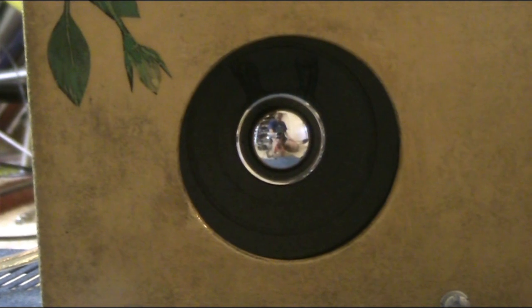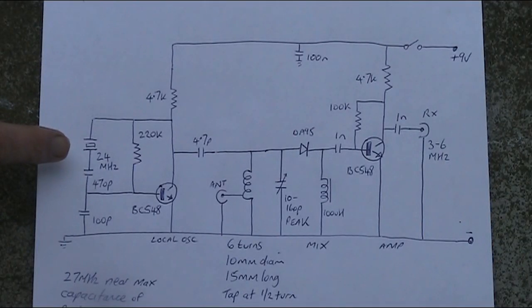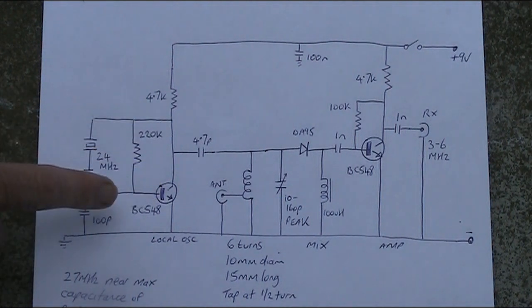As for what's inside, very simple — just two transistors. One is the local oscillator using a 24 MHz crystal. The other transistor is an RF amplifier after the mixer, and the mixer itself is just a germanium crystal diode. So very simple, it doesn't even have an RF preamp, yet I'm able to receive signals over quite long distances. Here is the circuit of the converter. On the left is the local oscillator using a 24 MHz crystal — change that frequency if you want to use a different intermediate frequency. You can use almost any NPN transistor and this oscillator will work.